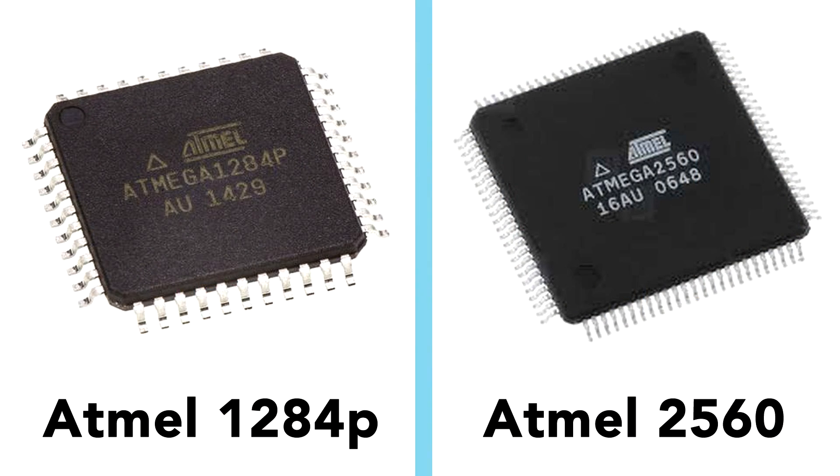You also need your printer that needs a bootloader. If you're not sure if your printer needs one, you can contact us if you're one of our customers, and we'll let you know. You can also just look at the board — on the left side we have the 1284p, and on the right side we have the 2560. Look for the large chip in the center; if it's a 1284p, it probably needs a bootloader.